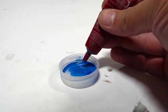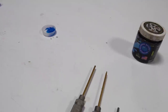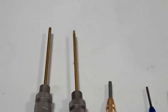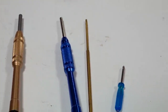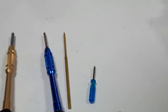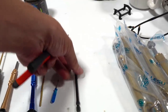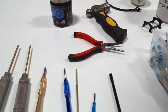If you're new to my builds, I always suggest using a Gatorade lid or a bottle cap so you can get some blue Loctite or thread lock. The bonus of these Lesu kits is that you do get your own tools — fairly decent hex drivers, some nut drivers, an extra 1.5 mil piece for your driver handle, and a tiny screwdriver. You would also want a 4.0 nut driver, needle nose pliers, a small hammer, and a razor blade.